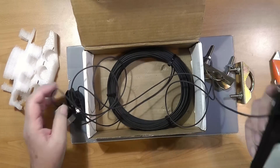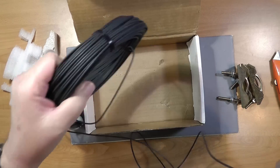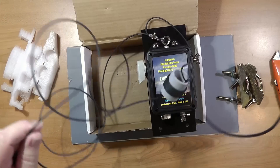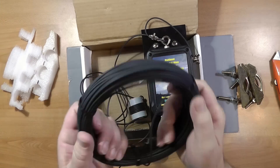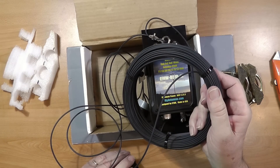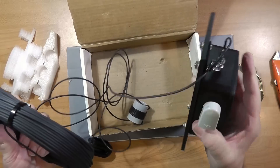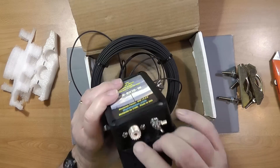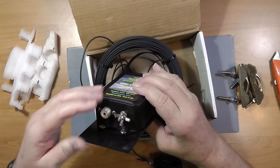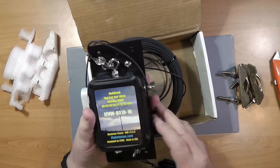The key thing in putting this together is it comes without instructions, by the way. That loading coil is pretty near the end of it. The wire is nice — I'm guessing 16 gauge insulated wire, so you can kind of string it through a tree if you have to. There is a coax connector down here, and a connector including a little solder connector that you can use for a counterpoise or a connection to ground.